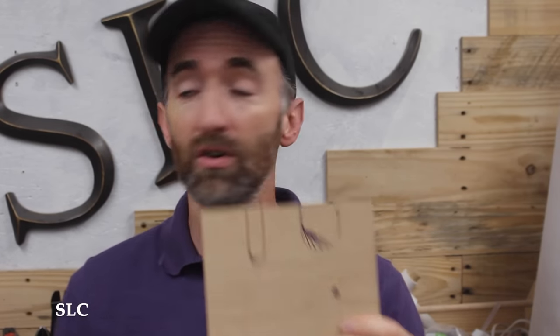When you're cutting with a jigsaw, you are limited to how thick you should be able to cut. When you're cutting softwoods, I'd limit it to about an inch and a half. And when you're cutting hardwoods, don't go more than about three quarters of an inch. And whenever you're using a jigsaw, always remember to use some ear protection and some eye protection because safety is always first. If you know of any other tips for the jigsaw, please put those in the comments below because we want to help out as many people as possible. Right over here I'm going to have a playlist with a bunch of other tips for tools, so make sure you check those out as well. Otherwise, get out of your shop and have fun building.